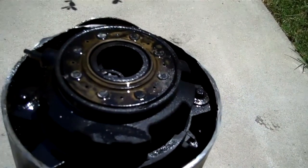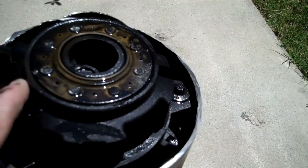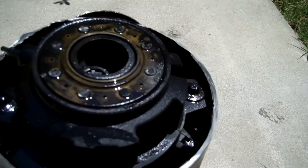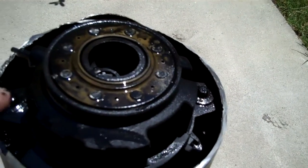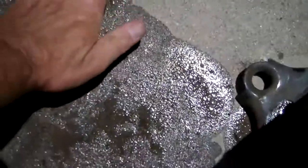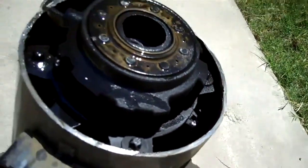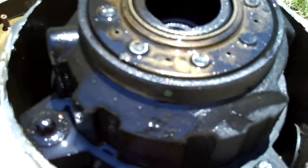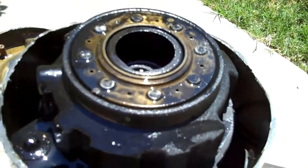Here's the inside of the scroll. Look how messy this thing is. It's a grounded-out compressor — I accidentally tipped it — but this is the oil. See how clean the oil looks. It doesn't look that dirty, but look inside that scroll. There's a little plastic piece here, probably for the oil return. It stays embedded in there with a couple of oil rings.